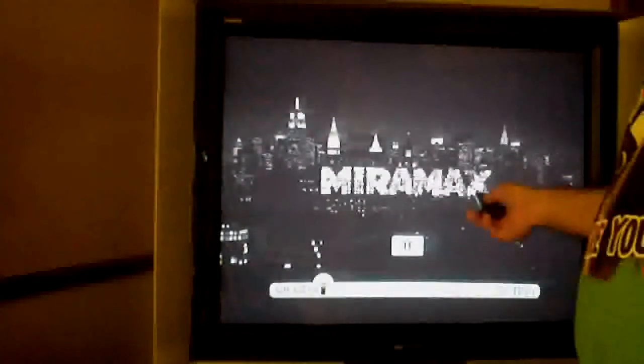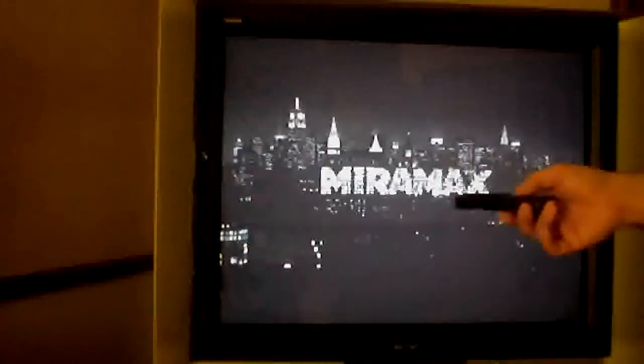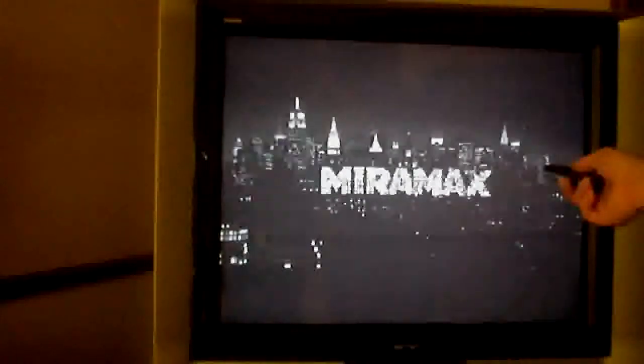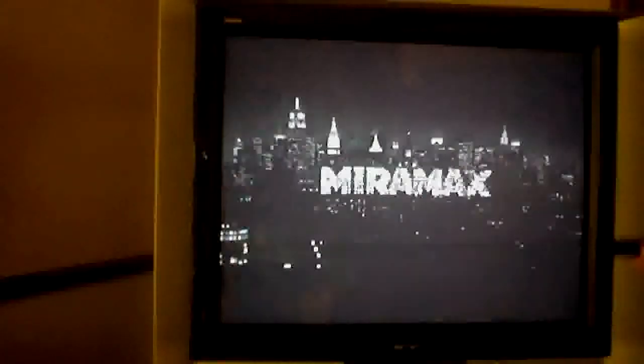See, it's jumping. It's kind of like there's some rhyme and reason to this. And I think what's going on is that AC ripple is leaking into the video composite, and it's heterodyning somehow with the video composite. And there you go. You get like this. 60 cycles creeping into the video, I think.